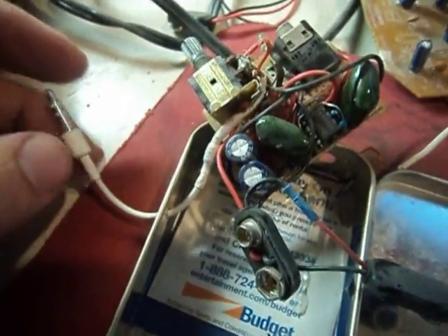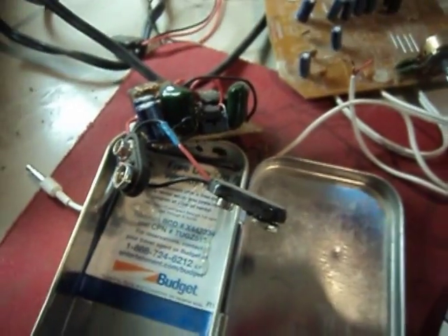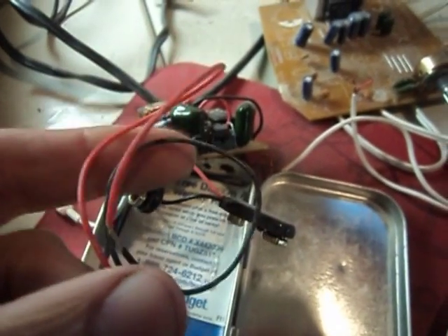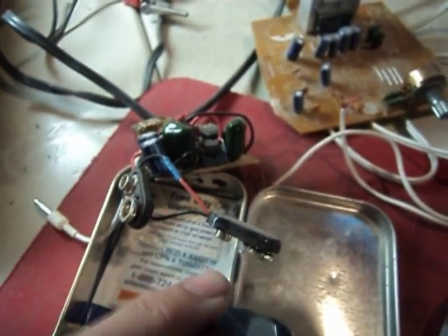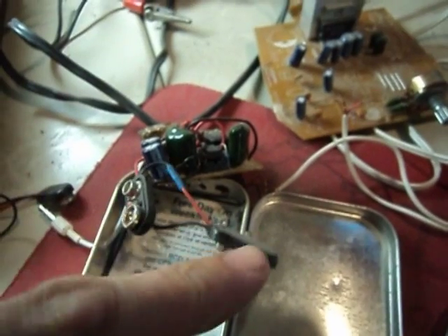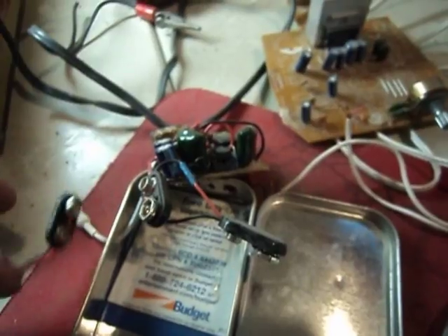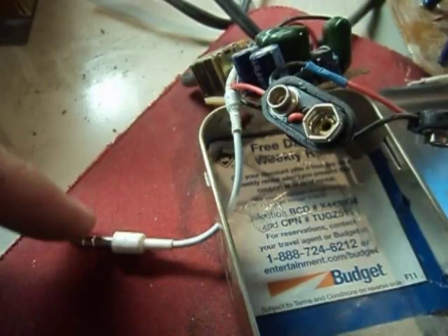This unit is actually wired for two batteries. I didn't know how loud it would be, so I made a battery eliminator — just a nine-volt plug with the two ends tied together. You put it on one of those and it closes the loop where the second battery would go. I think these are wired in series, so it just takes up that gap. If you want to do one that's either single or double, just get an extra nine-volt connector and you'll have it.